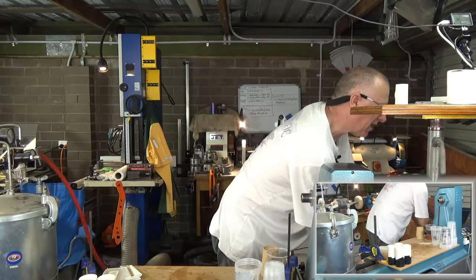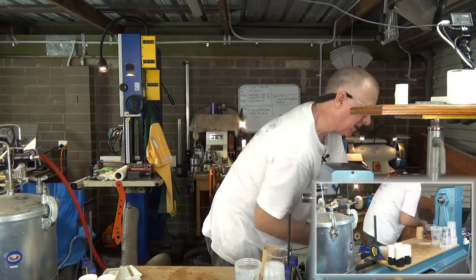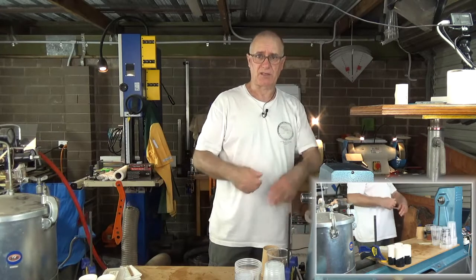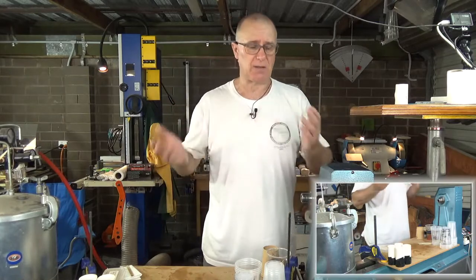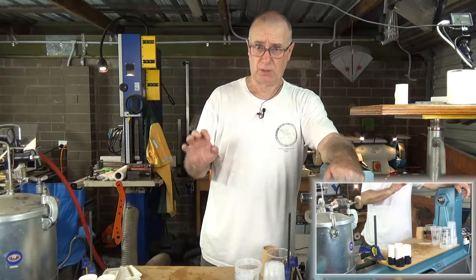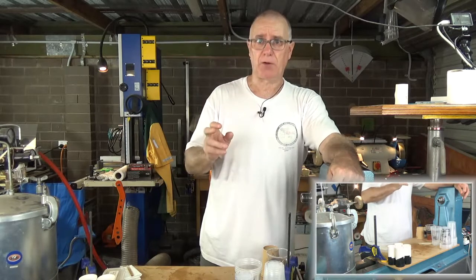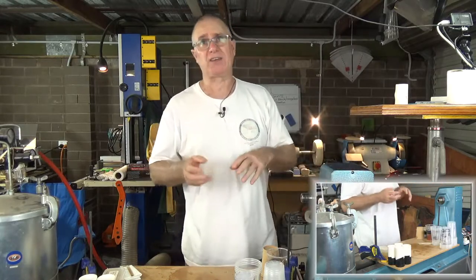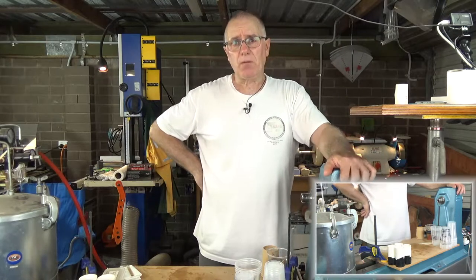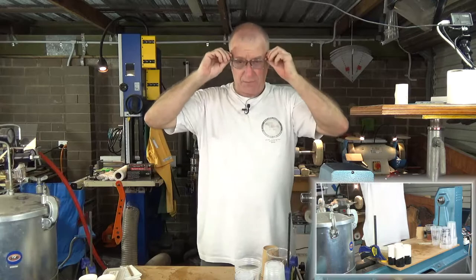Oh, okay. So it's one of the R400 handles, the aluminium ones, yeah? Mate, you should be able to steam that out no problem then, because the aluminium will take the heat no problem. So I would just get something, whether it's the kettle or whatever, to give you steam, even if you've got to boil it over a pot, and just have something to hold the handle, because it will get hot. If you can get that over steam, mate, you should be able to get the knot out of an aluminium handle no problem. It's more the resin and the acrylics and timbers that you can damage with the steam. You should be able to get that out nice and easy with the steam, I'd say.